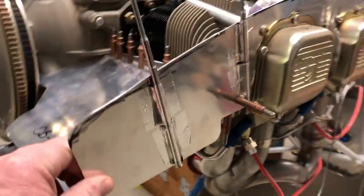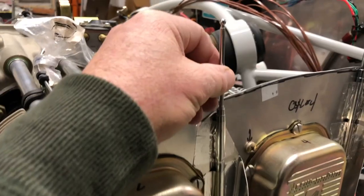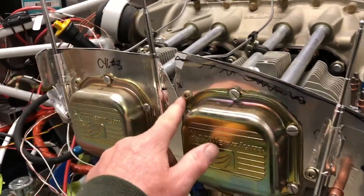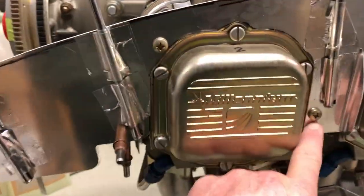I took the old baffle kit material from what I'll just call the old school kit, and I chopped it really, really low. I got some aluminum tape and some of these little telescoping rods — basically like a little antenna, used in this case to make little inspection mirrors. I built these, cut down on both sides, trimmed it all out. Then basically built templates, using the holes where the screws go in on each of these cylinders, and also across the back — similarly chopped down to where you can use certain points as reference.